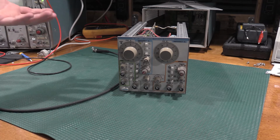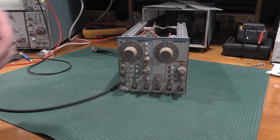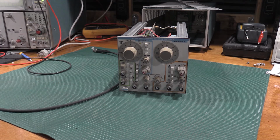And the oscillator quit working. I was doing some final testing, thinking I was going to continue on with the video, get this thing fixed. And it fell apart. So the waveform fell apart. Moved it up to my powered bay with the fan, and as the room cooled off, the oscillator came back. So I'm like, okay, well, this seems to be thermal related. As the room cooled off, it got better and better and better until it finally was working again.